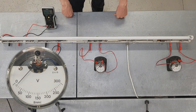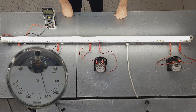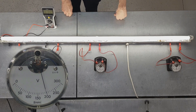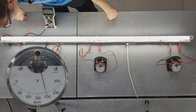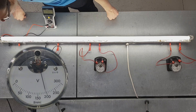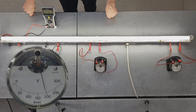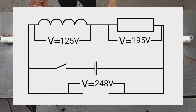So if I could ask my glamorous assistant to power that back up for me. So that's interesting - we were expecting to get 123 volts, and what we've actually found is if we have a look at our voltmeter now we are measuring just under 200, so we perhaps call that 195. So we've actually got a very, very funny reading here. If we look at our circuit diagram we're putting in 248 volts and then when we measure the voltage across the choke and measure the voltage across the lamp it looks like we've got more voltage inside the circuit than we're putting into it.